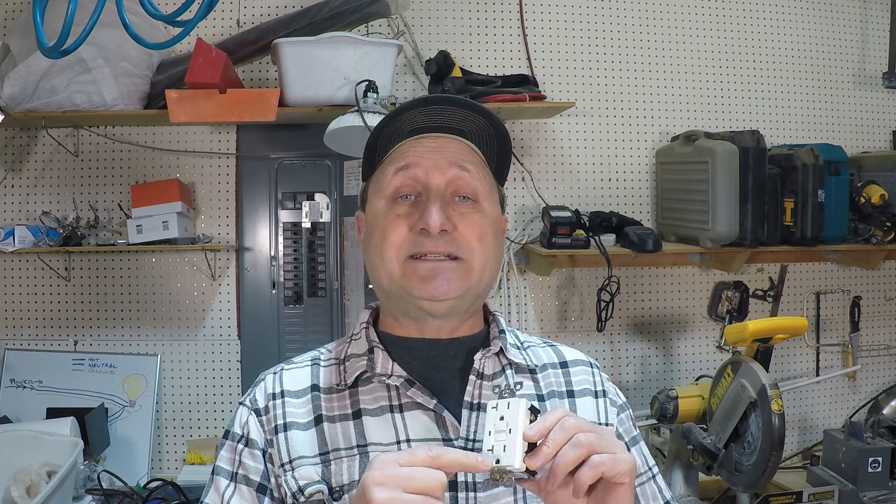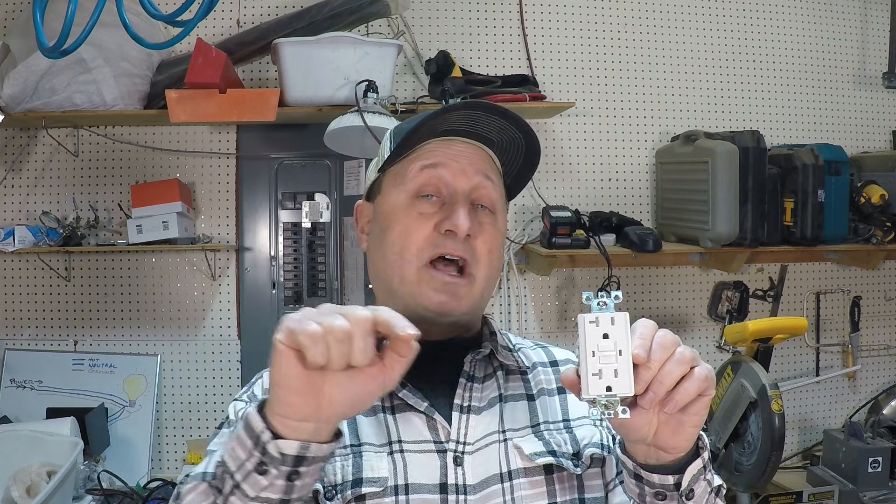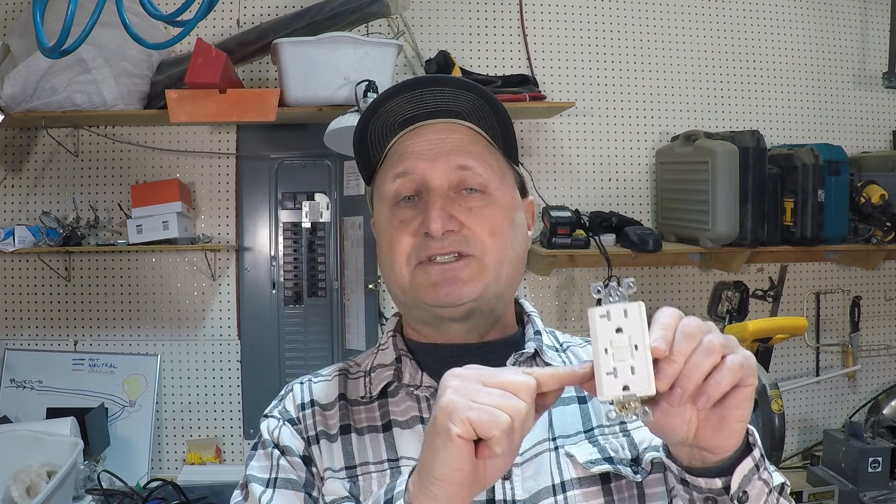One of the main reasons why a GFCI outlet may trip is because either the outlet itself is overloaded or something downstream from the outlet is overloading the circuit. The GFCI outlet is supposed to be the first outlet installed in the circuit. So if you have your electrical panel and a circuit wire coming from the panel, the GFCI outlet is the first outlet it's supposed to meet before continuing on to the other outlets.